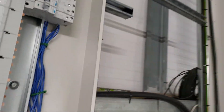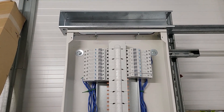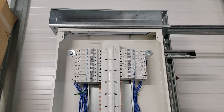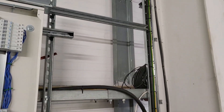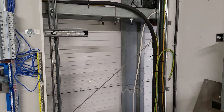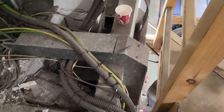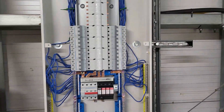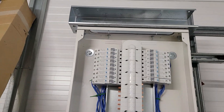They're not going to stay like that — we've got to put a load more containment up still. We've got circuits entering a distribution board below this one at the minute. They're all going to get pulled back, adjusted and moved up into this one. We're not quite sure how the final containment is going to come together. We've got a big shutdown window where we're going to do all of that work — rather than build something into position that's not going to end up right, we're just going to wait and tackle that all as one job. You can see there's a lot swooping around this side of the pillar. They all drop down into the main intake area below, which is part of the main mechanics workshop.